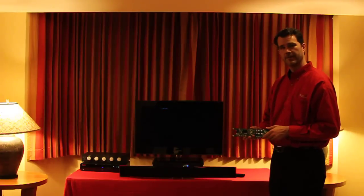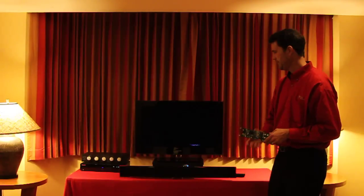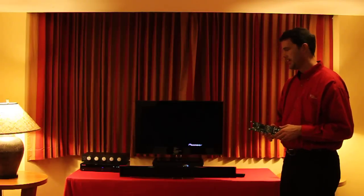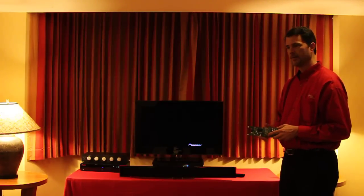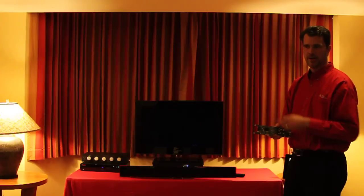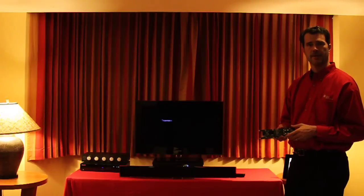They are the TAS5713 — 50-watt mono parts — so we've got 50 watts mono left and right, and we've got our CC8520 wireless transceiver communicating to the subwoofer, being driven by a Class D amplifier, TAS5616, at 125 watts.